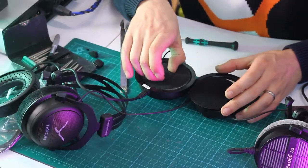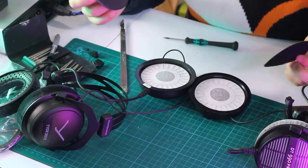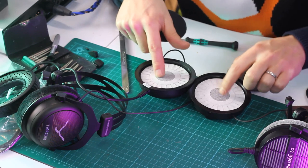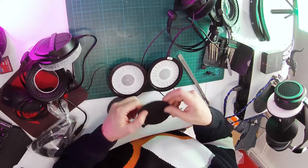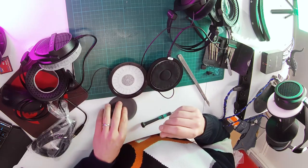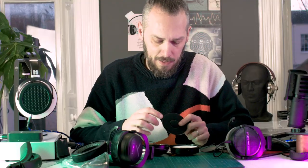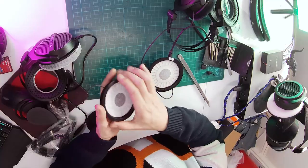Money shot — what's going to be under here? It looks the same. So this is definitely thicker and it goes over the centre of the driver. You can see the centre, the thinner bit of paper here, which is where the actual diaphragm projects the sound through. You've got a larger damping area there. These bare drivers do tend to have a bit of a peak in the treble — I haven't had a listen to these yet, but I suspect that's going to filter out some of that treble and smooth them out a little bit.